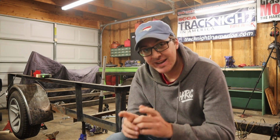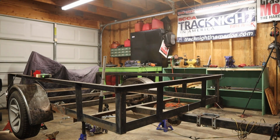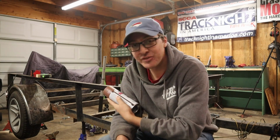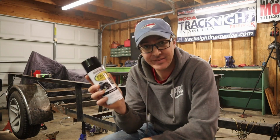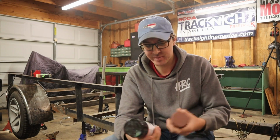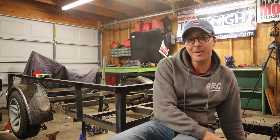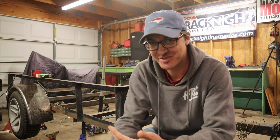But before we do that, I bought some paint. I've got rusty metal primer so that I don't have to completely spotless this thing, and I got some farm equipment heavy paint. Now this is spray on, so it's not going to be super durable, but I think this is going to be more durable than not. The spray paint goes on way thinner than automotive paint does, so it won't be the best, but it'll work fine for a little trailer like this.